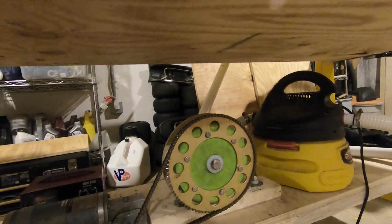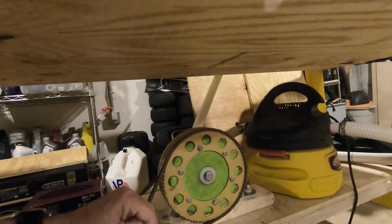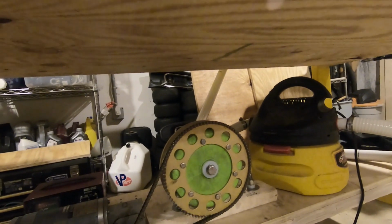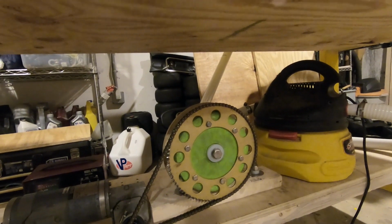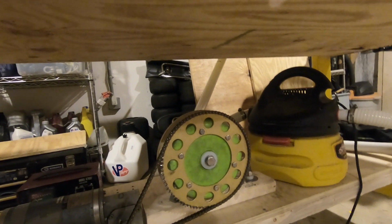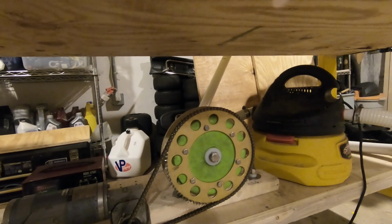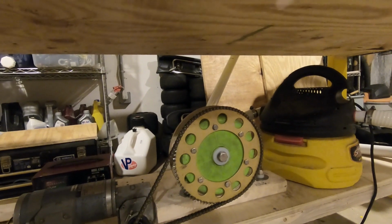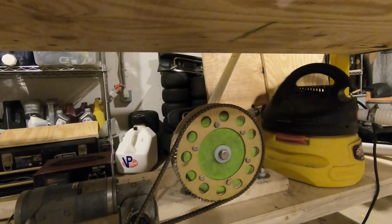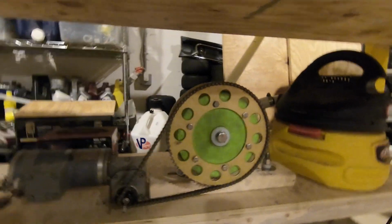And an important detail is the holes are arranged such that the part of the cycle in which the patient is inhaling goes through twice as many degrees as the part where the patient is exhaling. That just mimics natural breathing better. We inhale more slowly than we exhale. And that's it. The rest of it is simply vacuum cleaner with the hoses attached. Let's show you how this works.